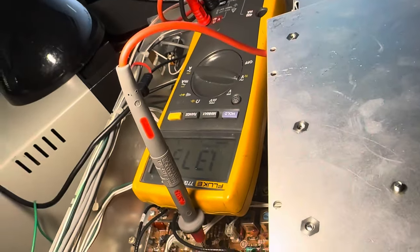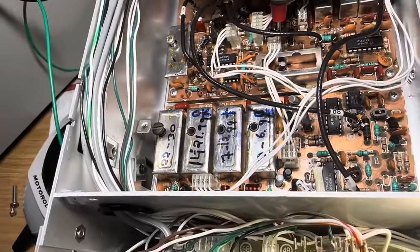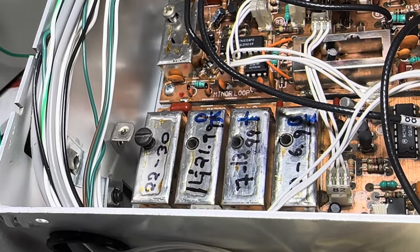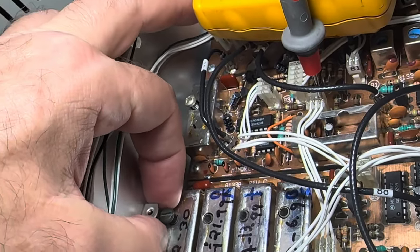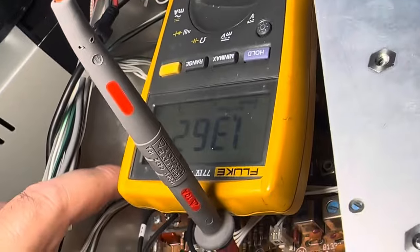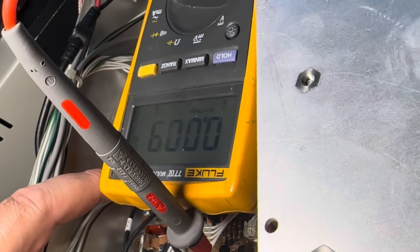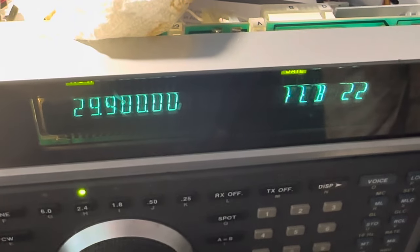With that information you can try and dial this value down into what locks. You can fool around with these coils — meaning you can turn the slugs or whatever you want to do — to get that number as low as possible on the band and range you're working on. Once you do that, you'll find this number will sink. I'm working on the 10 meter band, and I know this thing wants more inductance. Watch what happens when I move that little screw down for more inductance — the number is changing, and now it's gone to zero, no pulses. So it's in lock, and you'll see for sure we're right there in reference.